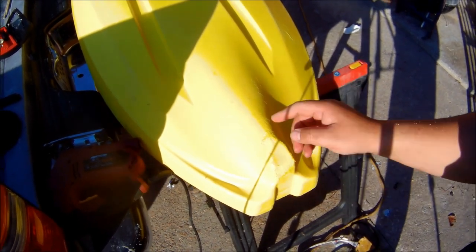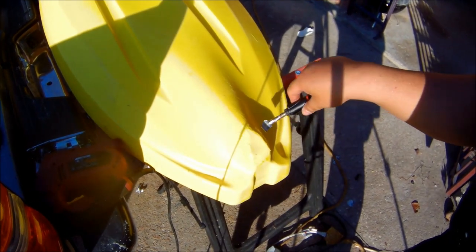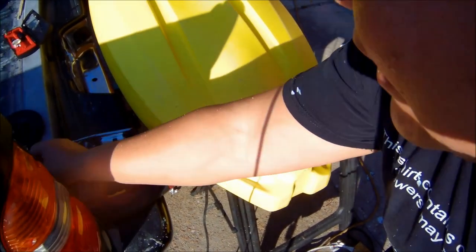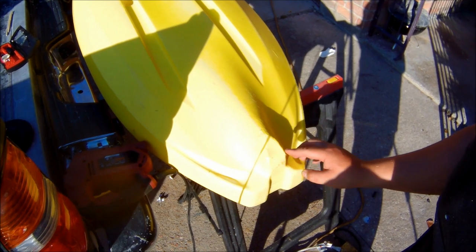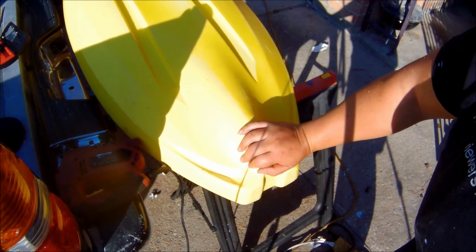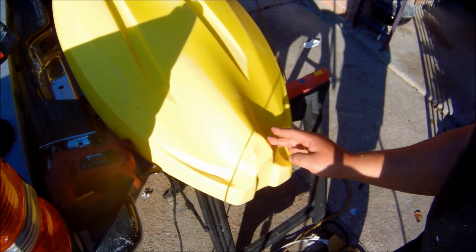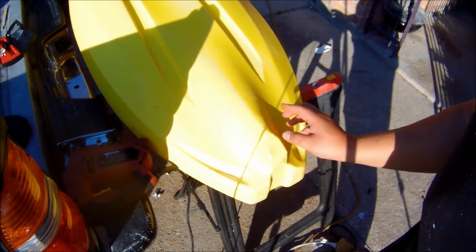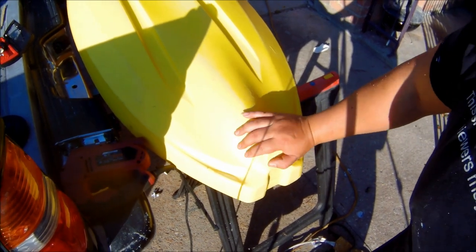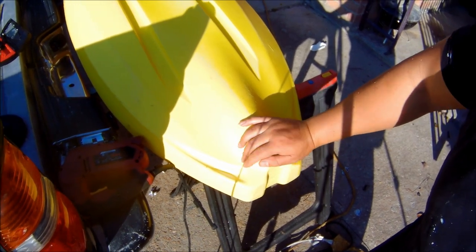And then from there, you just use the welder and a little spoon to push it around to blend the plastic into the kayak. And then I used the heat gun to keep things warm, because you want the temperatures to be pretty hot to where it's still malleable, and just keep pushing it in, making sure that it bonds together well. Once it's done, it's not gonna come off, and it won't leak anymore.